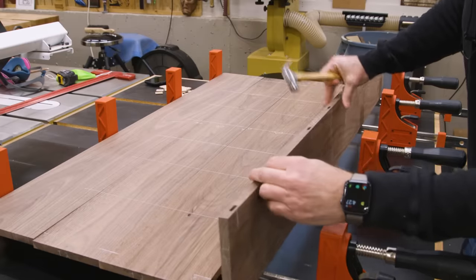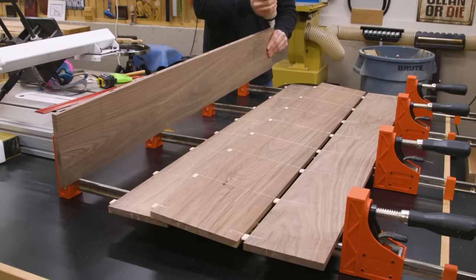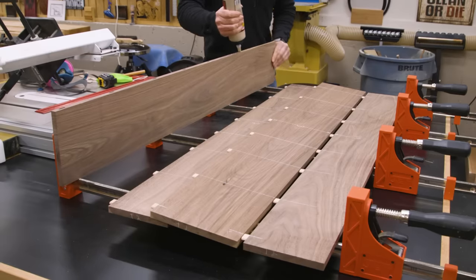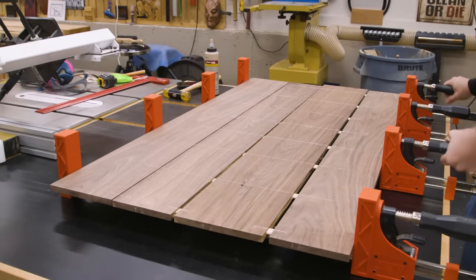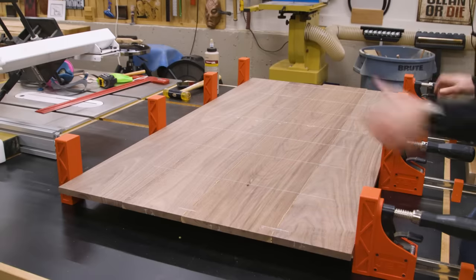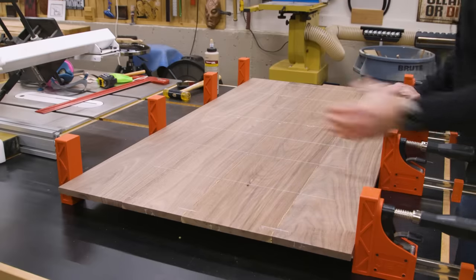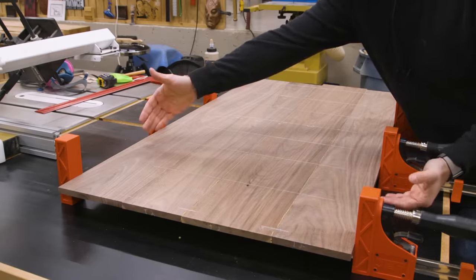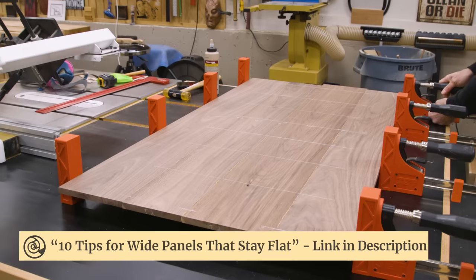Dominoes are way more fun if you put them in with a baby hammer. Just a nice bead of glue along the edge. If you don't want to do dominoes for alignment, you can just go for it and hopefully your boards are flat enough that they stay in line, or you can use cauls — strips of hardwood, one on each side, sandwich it together and that will clamp everything nice and flat. I do have a video on some tips for making nice wide flat panels that you might want to check out — I'll put the link in the description. And how do you know when you've added enough glue to a joint? Pretty much when you see a nice even bead of squeeze out all the way across.